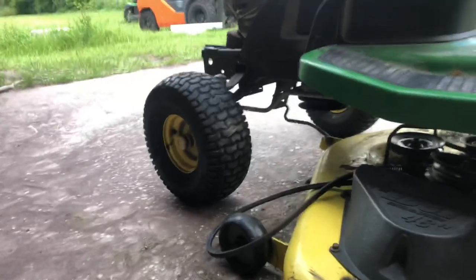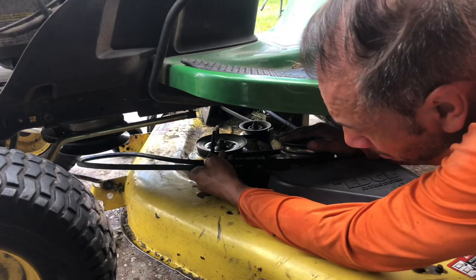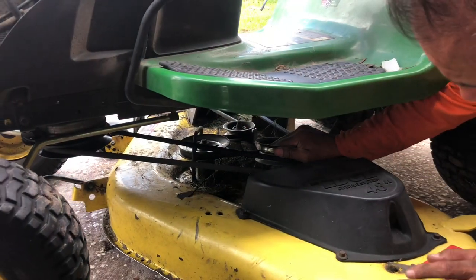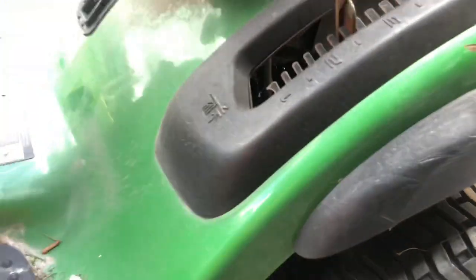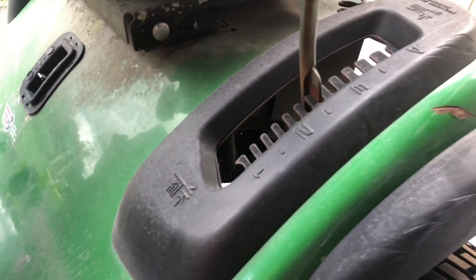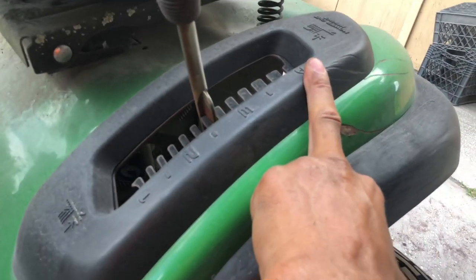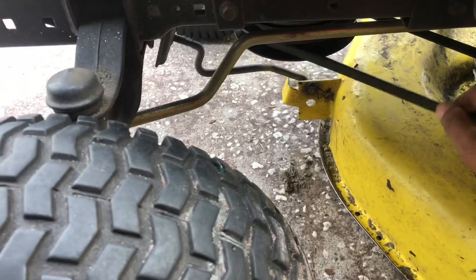And the final part is the belt on the pulley. Remember what I did last time — all you do is do the opposite. Push and allow it to go on. Now this belt is going to need changing soon because I can see the slack. So that's all on. All you do now is push down and up. I normally cut at about two and a half to three going down. If it's a heavy cut I'll go up to four; if it's a medium cut, in between three and two and a half.